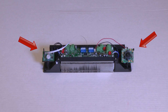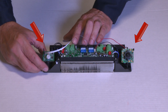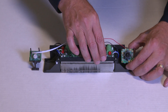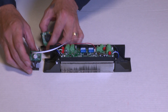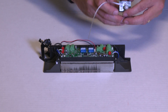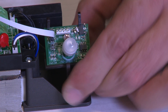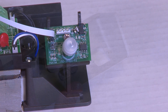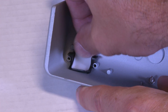The physical position of the camera and PIR module may be reconfigured to be located at either end of the MagnaLock as desired. To remove a module, first disconnect the wiring, then compress the legs of the support bracket and slide the bracket out of the retaining rails. To install a module, compress the legs of the support bracket and slide the bracket into the retaining rails, then reconnect the wiring. Use a number one Phillips screwdriver to remove, reposition, and reinstall the inserts in the cover as necessary.